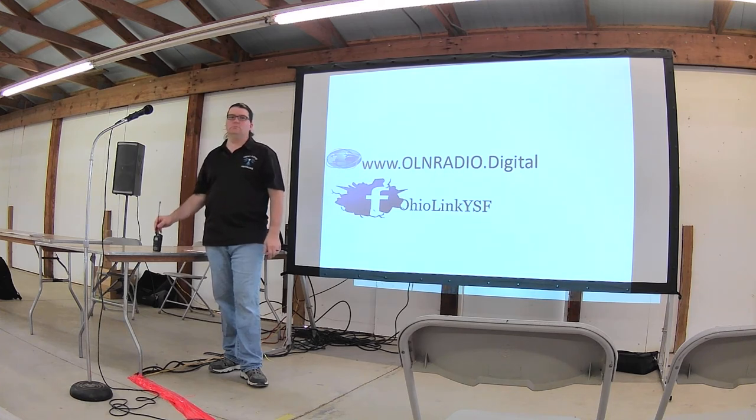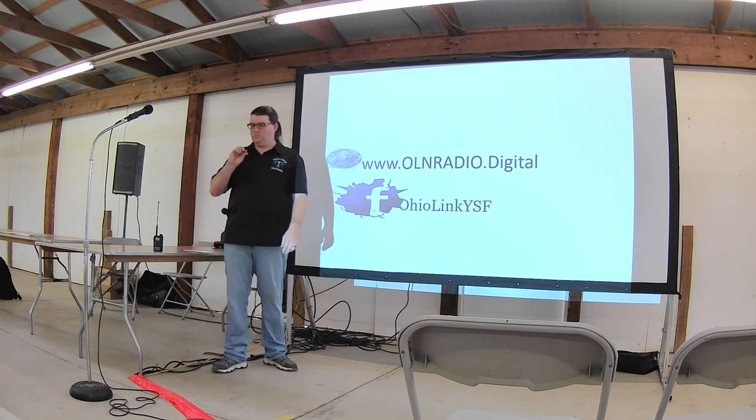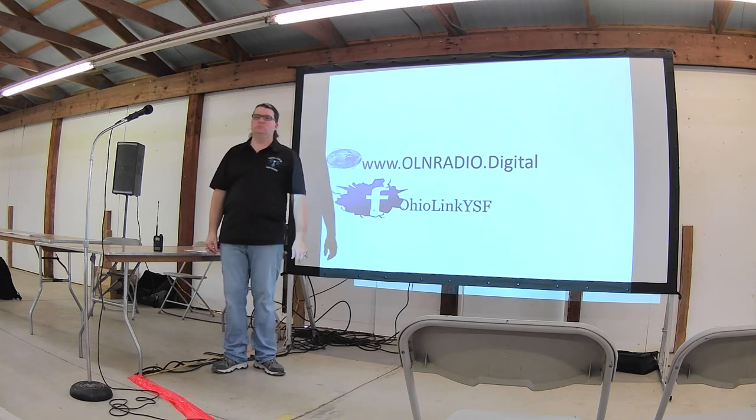Then I keep a solid two Mississippi before I transmit, and it seems to work flawlessly. Yeah. If you fast key on these, and also, like we said, if you're in Kansas City and you key up that repeater, you don't know what their connection is like or how many hops they've got. But pretty much, if I get two Mississippis, I don't miss.